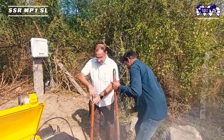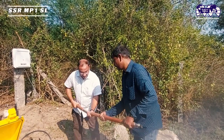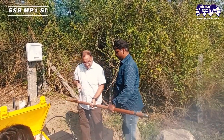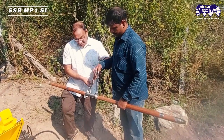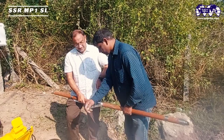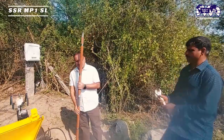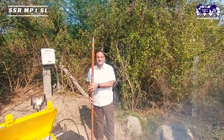Now we are connecting the probe. You simply place it and screw it. The unit is supplied with a spanner — just tighten it slightly, don't force it, just get a locking grip. Once it is secure, for safety we suggest placing insulation tape over the connection.